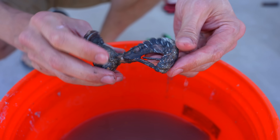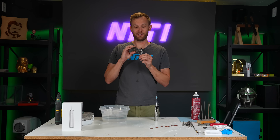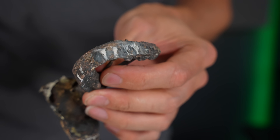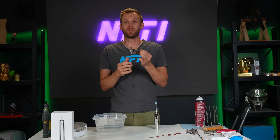Look at that! All of the teeth look fantastic. Those look great. Now this casting is looking great, and I need to do a lot of cleanup work. I need to cut off all the extra metal and start cleaning it with grinding tools and sanding tools. But before I do that, I've got to get all that extra plaster out from all the spots between the teeth.